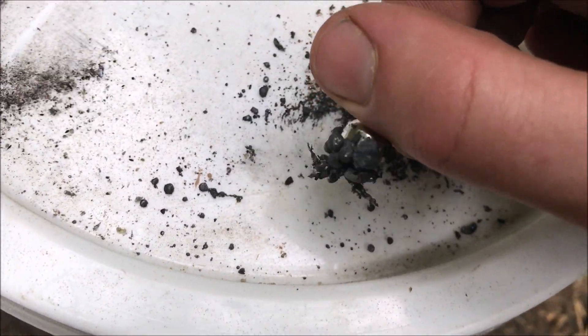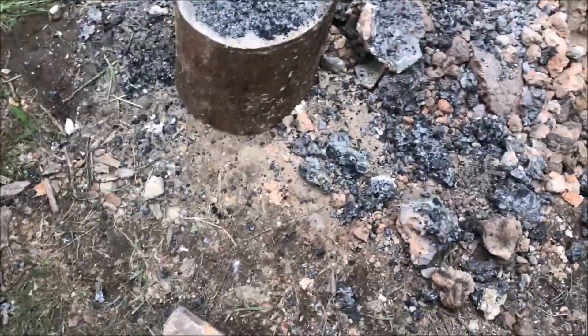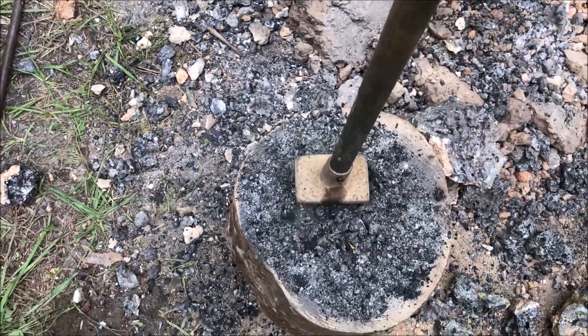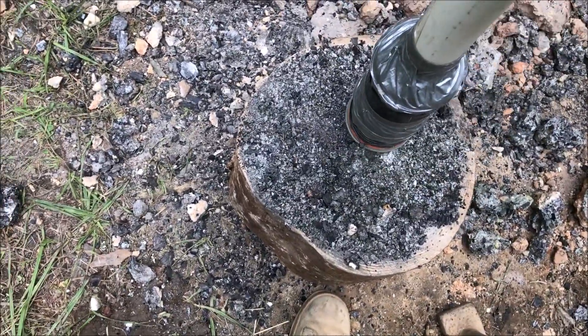As you can see, I just pulled these out with the magnet from my slag pile over here. What I'm doing is finding all the good pieces of slag — the ones that don't have rocks and stuff in them, that look like they're completely melted — crushing them up with the tamp, and then going over to the magnet to find all the BBs out of it.